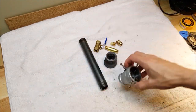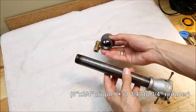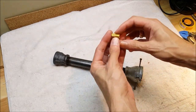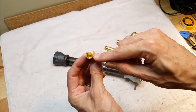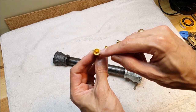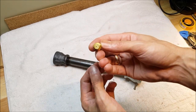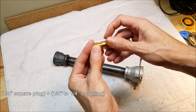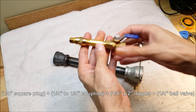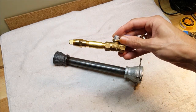Here's how we put this all together. This is our mixing tube — this goes on this end. This part here goes on this end; this is the nozzle. I also lost the footage of this, but you want to drill a hole as much in the center as you can with a number 57 drill — that amounts to about 1.09 millimeters. It's tiny. This gets mounted to this, to this, to this, and that attaches to the holes. So now let's put some Teflon tape on all this stuff and get it all together.